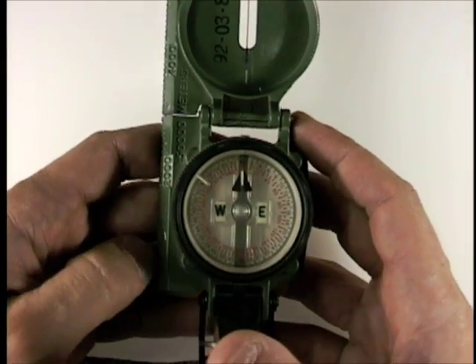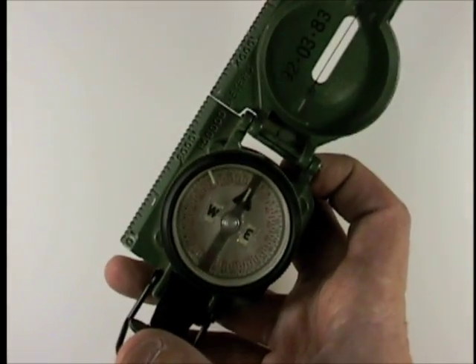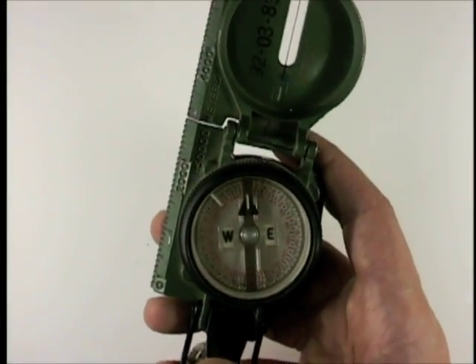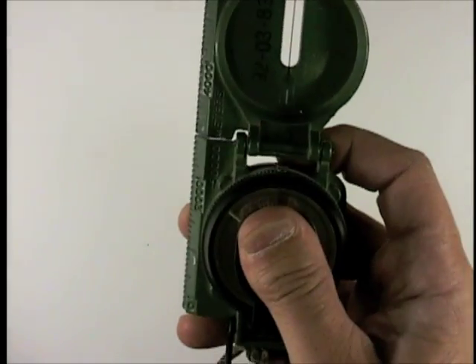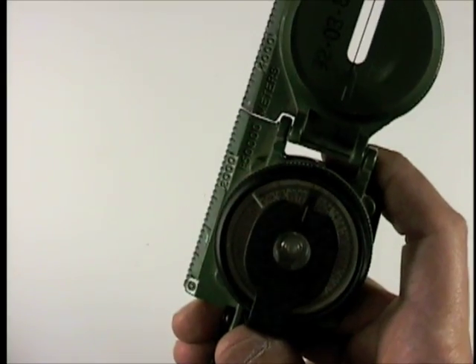The locking is because it's not a fluid dampened compass, but a magnetically dampened compass. Although it dampens quite well in the normal dimension — it only wobbles back and forth a moment — it can wobble up and down and, in theory, be damaged from, say, jumping out of airplanes or stuff like the Army does. So all magnetically dampened compasses lock the needle so it doesn't wobble when it's in the closed position.